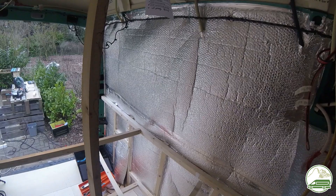Now we are placing the first wooden beams from side to side. The one in the back is in line with the dividing wall at the end of our daughter's bed. The other one is approximately in the middle of the double bed so it has an extra support function. These two beams also hold apart the horizontal beams on the sides so they can't move inwards.